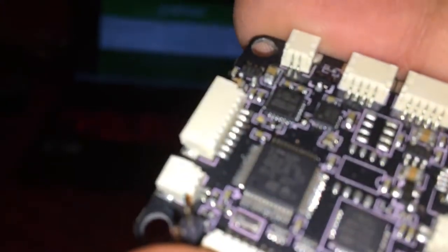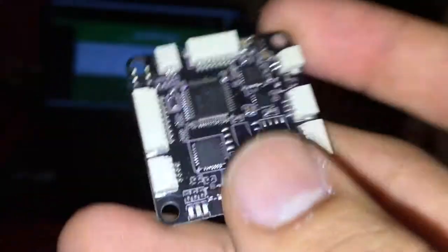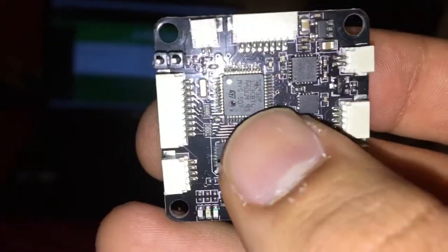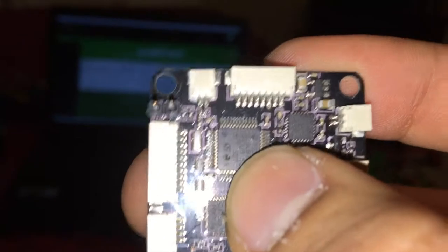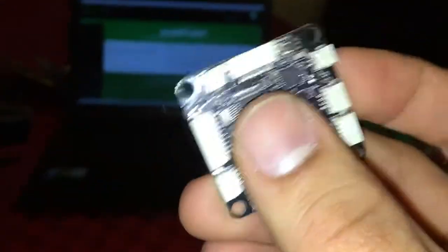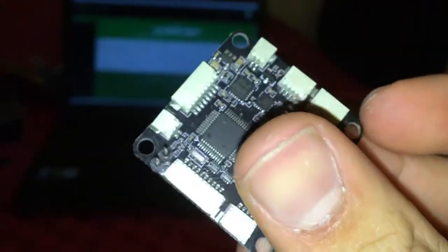On the front top part of the board, right here, you can see a bulge and a hole. The chip blew its guts right up — it just failed mid-operation. Whenever it's given any kind of power, it starts heating up like crazy, so it's an internal short of some sort.